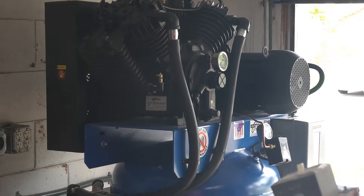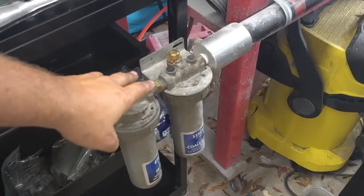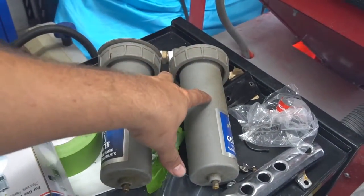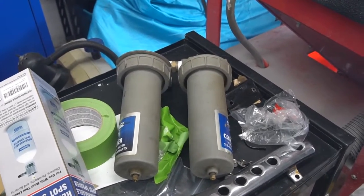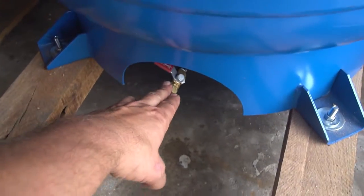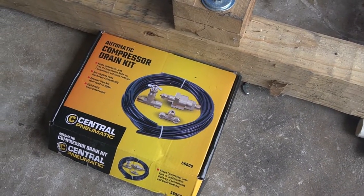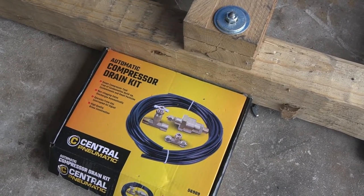The next video I'll do some modifications because I'm going to use this on a blast cabinet. I need moisture management — I already have a Graco Sharp Air Membrane Dryer set up, plus two moisture filters and coalescing filters that collect oil. I'm going to mount those on the air compressor and also bought an 8 kg air cooler, kind of like an aftercooler setup — looks like a radiator — with some copper lines. I talked to Polar Air Eaton and adding this feature does not void the warranty. I'll also add this auto drain from Harbor Freight where the ball valve is, and I have an electromechanical hour meter timer to track hours and schedule oil changes for the warranty.